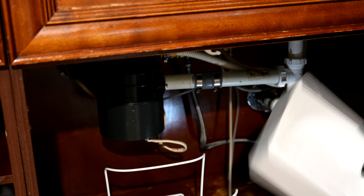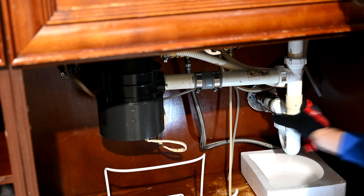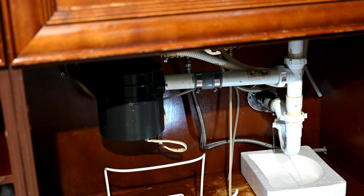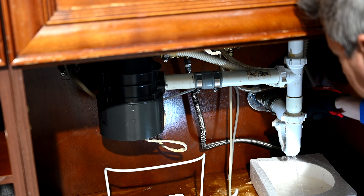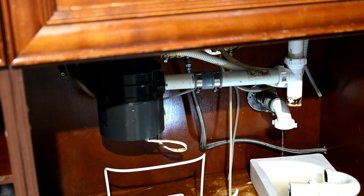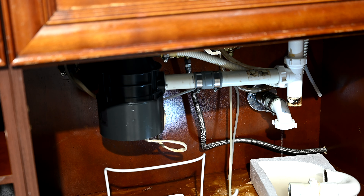I've got my professional plumbers pan here. We're going to drain out the P-trap so we can remove it. Just let it equalize for a few seconds before you do the rest of it. Oh dude, it stinks too. That says to me we didn't have a slope going back towards the wall — there should be a downward slope. Otherwise the water wouldn't be running back out that pipe like this.